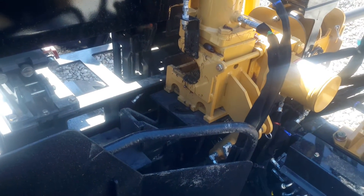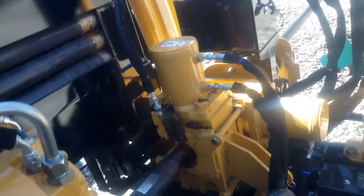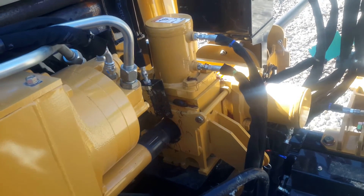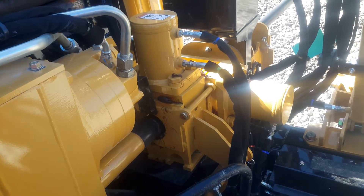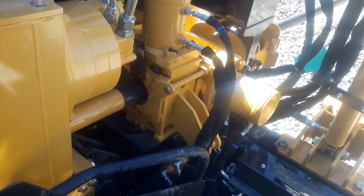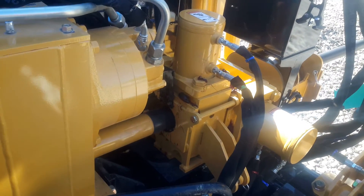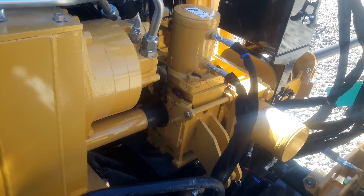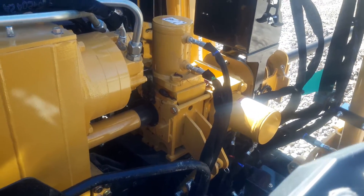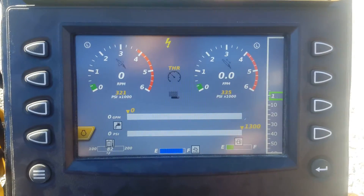Come back down to get our next rod. When we come in for the next one, we're going to rotate nice and easy until we bump it, then quit pushing and let it rotate nice and easy until we complete our makeup. Open our jaw and go for the next rod. That's it for this video.